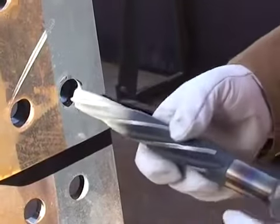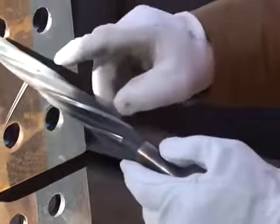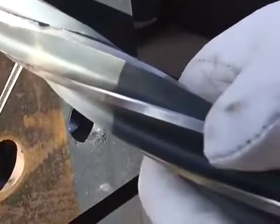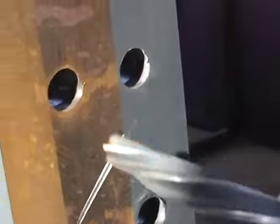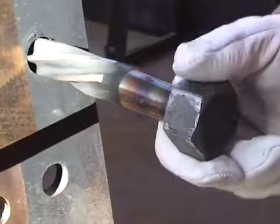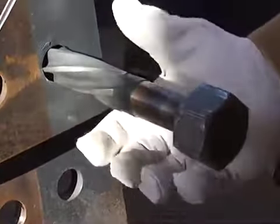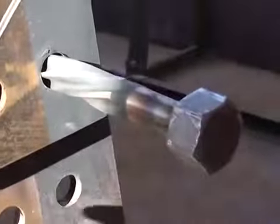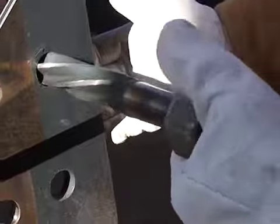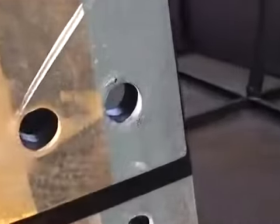so that we can fit a bolt. If you use a tapered bridge reamer, never put it in reverse, as it destroys these flutes like someone's done there, and then it's not going to cut very well for you. Another thing you absolutely never do is use this with a universal joint on the end of your rattle gun, because if it wobbles, this steel is such a high carbon, it'll snap off and fling that thing out for you. So it does require a bit of due care when you use a tapered bridge reamer, but it's a tool to use to align misaligned holes.